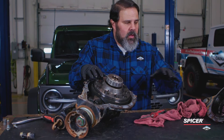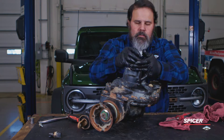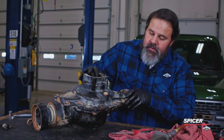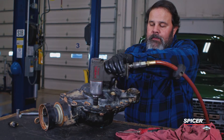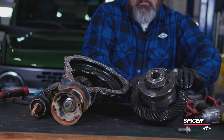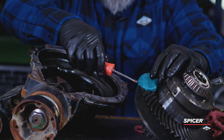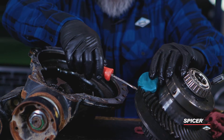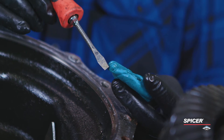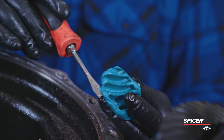We've got our differential seated. I'm going to put the cover on and tighten a couple of bolts. Our cover is seated all the way around. You can see on our kids' putty that the teeth don't even start to show through — there's real depth of the putty between the top of the tooth land and what would be the case.